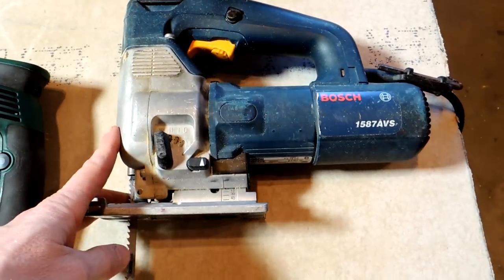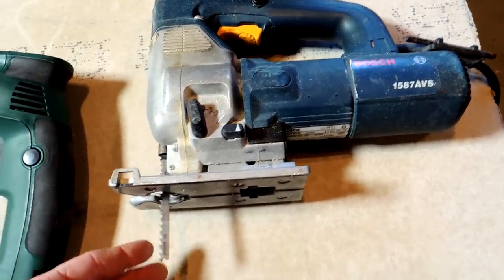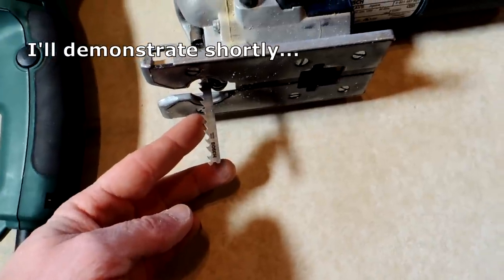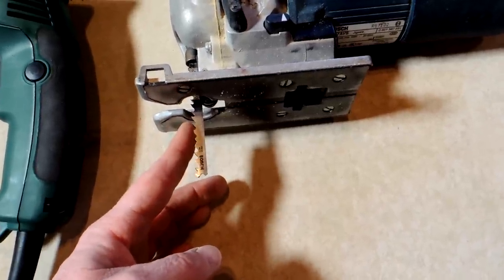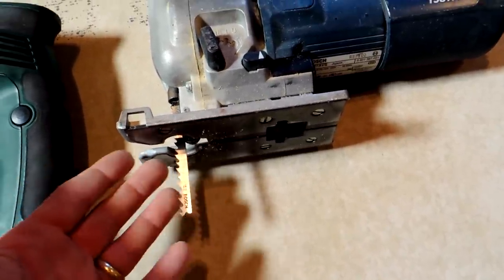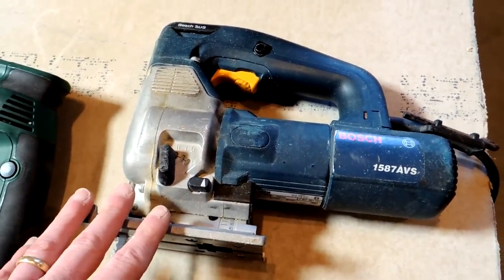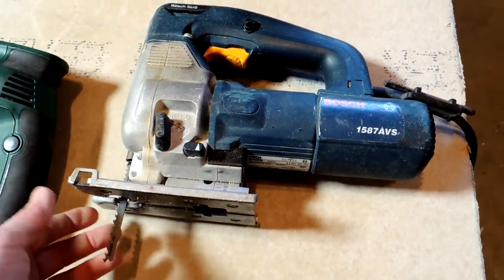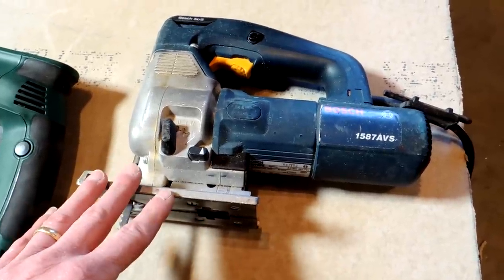The fourth method is to use a jigsaw. This is a method I still use, and it's not bad — especially for a homeowner if you don't want to buy a dedicated tool. The trick is to use a very coarse blade; in this case it's a wood blade. They do sell blades meant for fiber cement backer board, but they're expensive and I'm not sure they buy you much more. I typically just use wood blades knowing I might only get one or two cuts out of a blade and then throw it out. In the course of a project, that's maybe $10 or $15 worth of blades — not the end of the world. A jigsaw can cut straight lines and curves, makes some dust but not that much, and it's definitely feasible to use indoors if you're careful.